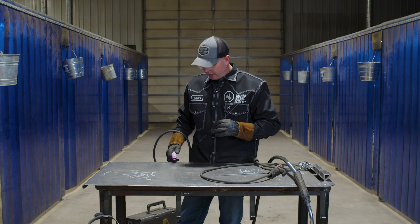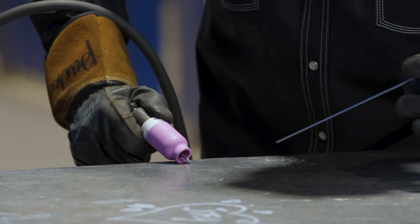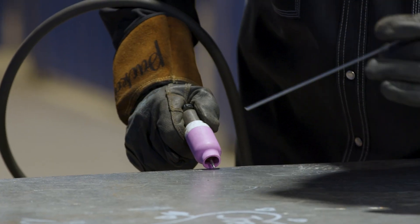You can walk the cup, which means you make contact with your workpiece with the cup, and then you weave that in a figure-eight motion to get it to walk forward. You touch your tungsten to the table and it initiates the arc, or you flick that wire across there and it initiates the arc. Once you get the arc going, then you start doing that figure-eight motion.